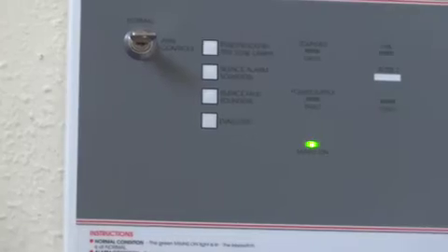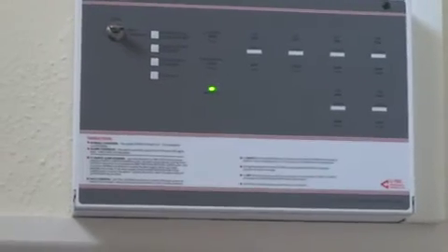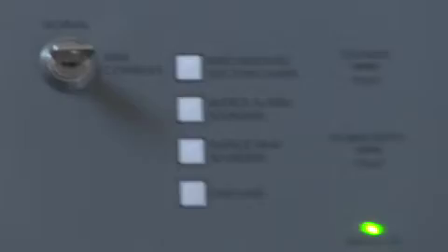When the fire alarm's activated, the system will go into evacuation and we'll have a look at the information being provided to us. The first button I'm going to press is silence alarms — that's to stop the sirens, otherwise you won't get to hear me. So Gary's activated it. We'll turn the key. I've silenced that just to keep the noise down for a second. It's come up in Zone 3 — Zone 3 on here is somewhere on the ground floor.